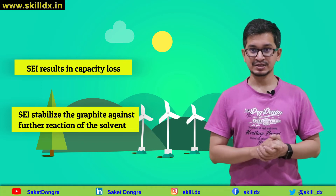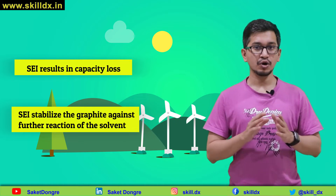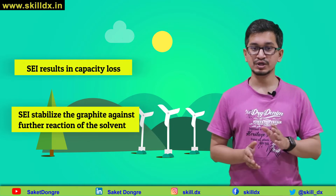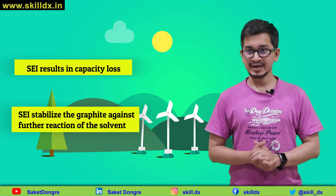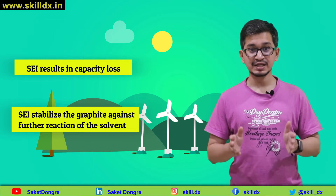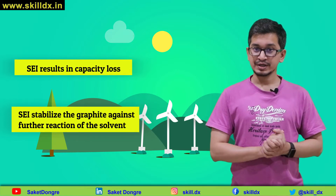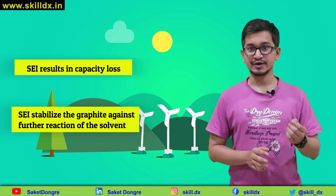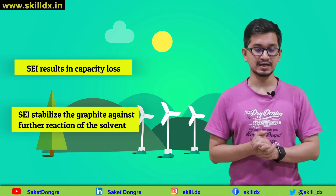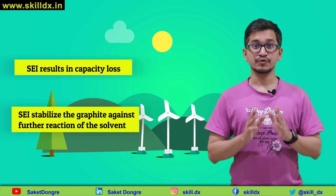When lithium-ion battery cells are assembled, they are in a fully discharged state at 0V. All of the lithium begins in the positive electrode, and the negative electrode is pure graphite with no lithium whatsoever, so no SEI has formed yet. When we build the battery cell, we must put it through at least one precisely controlled charging process. During this first charge, the graphite is lithiated for the first time, causing the chemical reaction that forms the SEI layer. Because of this, the first charging process is called the formation process.